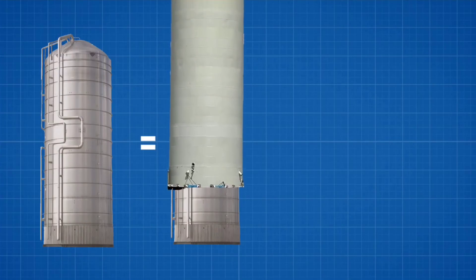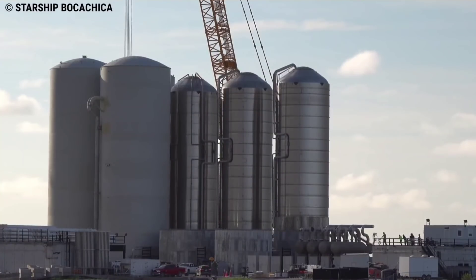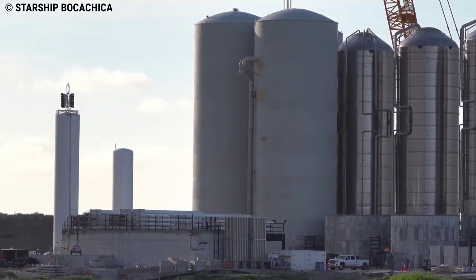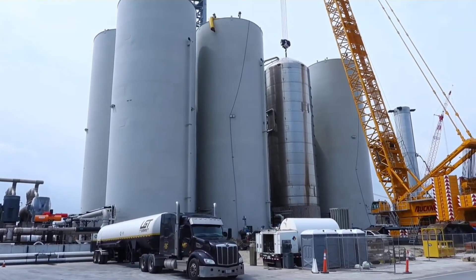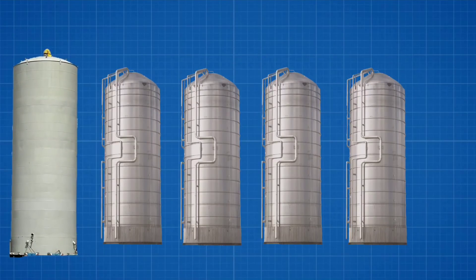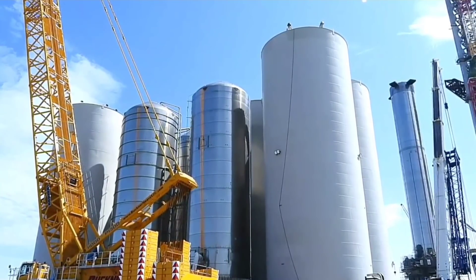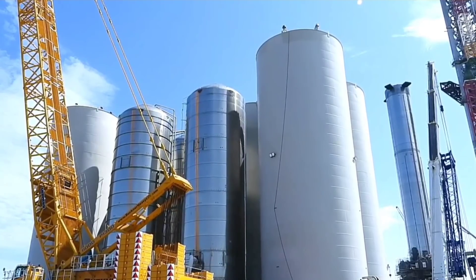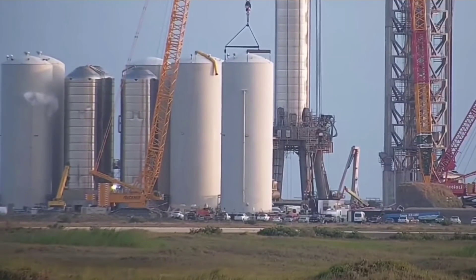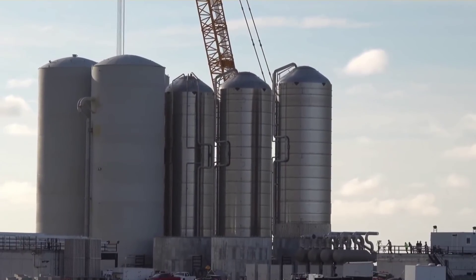SpaceX chose to manufacture those storage tanks itself, building structures virtually identical to the tanks that make up most of the flight-worthy Starship and Super Heavy airframes. However, if SpaceX were to simply use those unmodified tanks, it would be almost impossible to store Starship fuel for more than a few hours — or maybe just a few minutes — without it warming up past the point of usability. SpaceX's final Starship tank farm design involves seven Starship-derived storage tanks and seven contractor-built tank sleeves, measuring around 12 meters or 40 feet wide and 40 meters or 130 feet tall. Those cryo shells will enclose all seven SpaceX-built tanks, allowing the company to fill the 1.5-meter or five-foot gap between them with an insulating solid, gas, or some combination of both. With those shells and insulation, SpaceX's custom-built tank farm should be capable of storing cryogenic liquid oxygen and methane for days or even weeks.